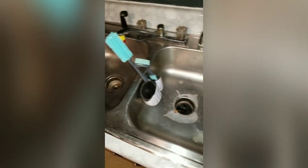Here are the final results — look at how shiny, sleek, and glossy they are. They're fully dried. We waited 72 hours because the product says dry to touch is 24 hours, and 72 hours means light use. So we're in a light use phase and wanted to give you a glimpse. Seven days up to 30 days is fully cured — at that point you can use it regularly. It has a glassy look and we are very pleased.